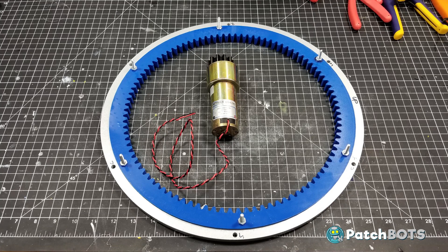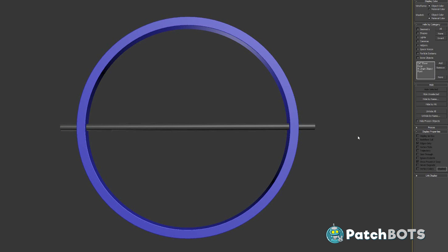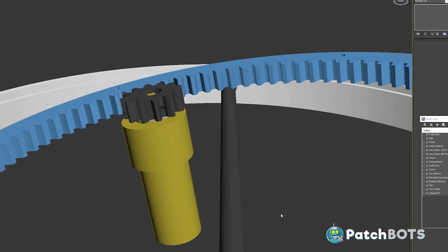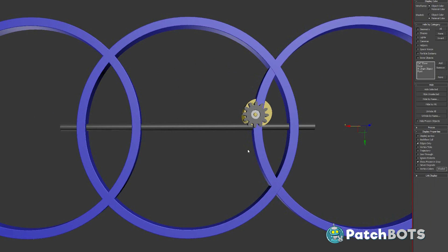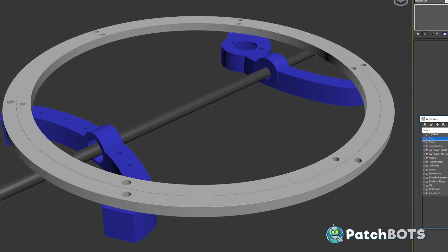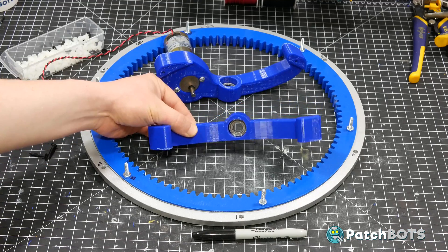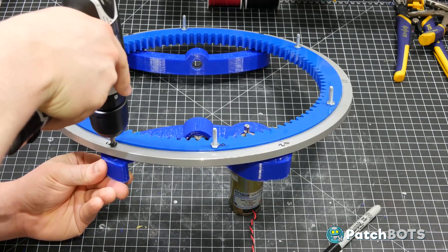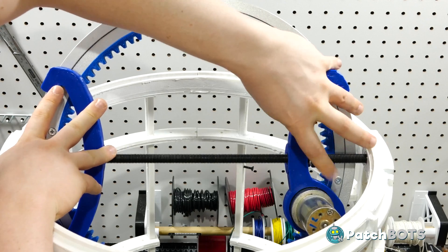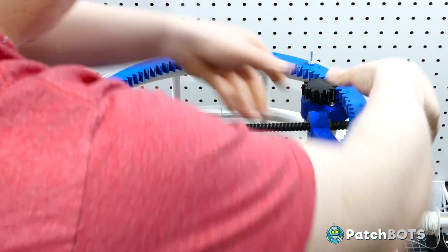Now we have to figure out how to mount these pieces to the frame. My main design is based off the idea of having a ring mounted to the bottom of the lazy susan. As I began playing around with the design I came up with this interior ring structure that I really like. I added the Pitman motor to the right side of the droid and wanted to keep the motor as close to the axle as possible so the weight would affect balance as little as possible. I refined the design and removed sections I didn't need until I came up with two shapes — they both mount to the outer ring and have a bearing installed to spin along the axle, and each has a step to allow the gear to rotate freely. The mounts are attached to the outer ring of the lazy susan using self-tapping wood screws, and the whole assembly is threaded through the axle along with two nuts and two lock washers to set the horizontal position. I attached some zip ties at the front to keep it level while everything was getting installed, and also installed the semi-flex wheel so now we can test.